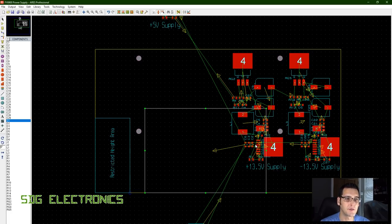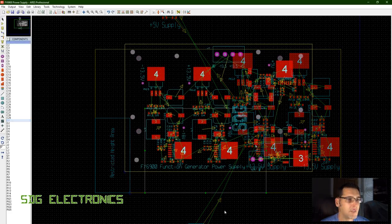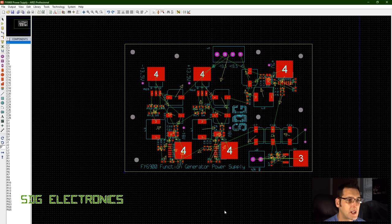After playing around with various layouts, I've decided it's going to work out best to separate the AC power module from the DC-to-DC converters. That keeps all the AC stuff away from the DC circuitry and gives more freedom for an optimal layout. It also means anyone making the PCB isn't tied to that particular power module — any 24 volt supply will work. I've added extra holes to be duplicated on the second board so the two boards can be tied together with spacers, and I've added labels and test points for checking voltages when bringing up the PCB.